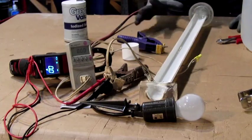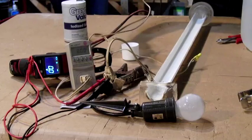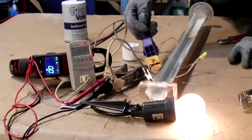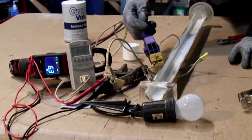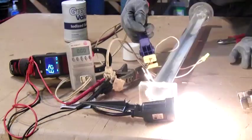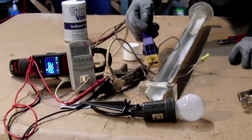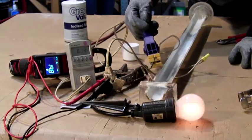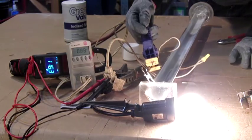I'm totally insulated right here. This is our contact point where they come together. If I take this, that is the equivalent of a switch — a contact. Light on, light off. There's a little spark that happens every time they make contact, which is actually what happens inside a light switch. I'm going to hold it on so you can see the voltage and the amps.